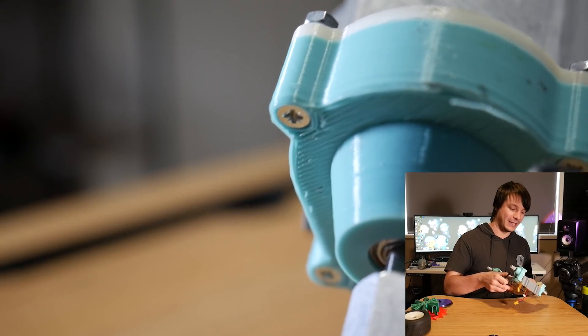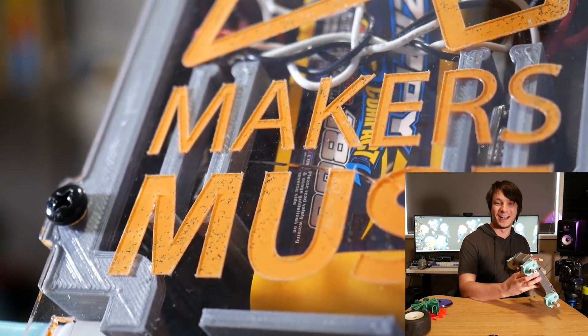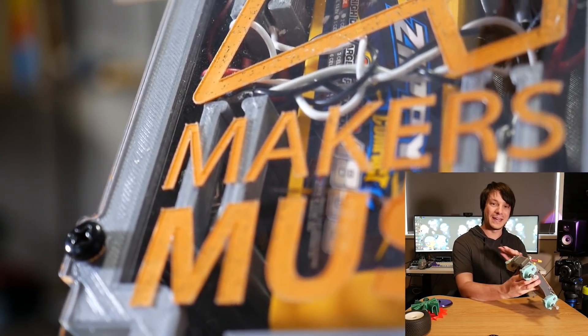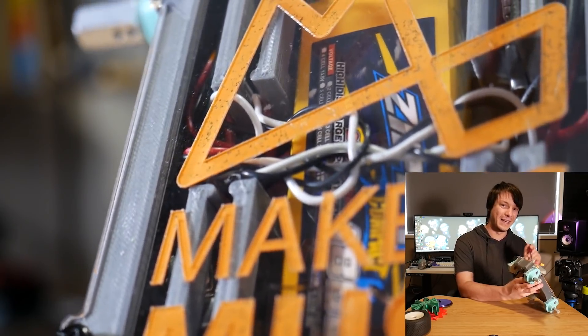Just looking at the frame there's a little bit of damage - a little bit of filament delaminating and that kind of thing. I did notice the top cover was actually cracked, so I must have hit something hard. With the acrylic, the way I've marked it is I've used a laser to score where the masking tape was and peeled away to paint in those specific areas, and I think that's created a stress riser which means it's been easier to crack there. Acrylic is very brittle anyway, so it's not too unexpected.